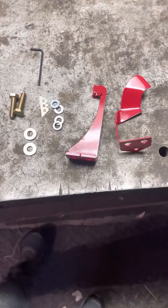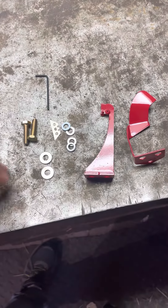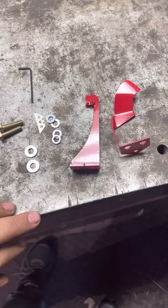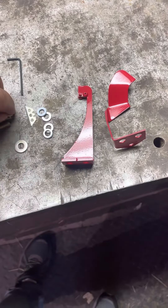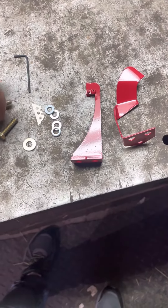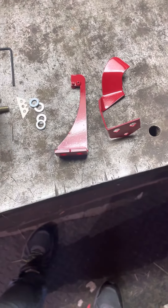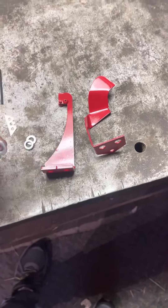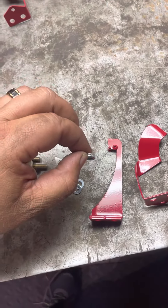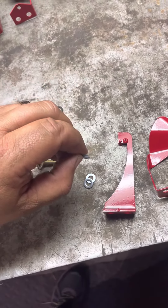What we have here is one of my update kits. These are the two replacement bolts that hold the knife and the retention plate. These two large washers go on these bolts on the outside. And these two spacers here — you might not need them, or you might if you think you need more because your twine disc has more backlash or a lot more wear in it. You might need more of these shims.